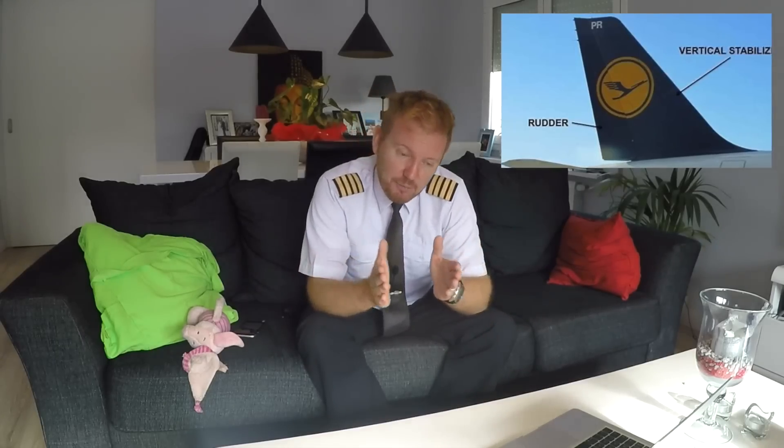The rudder is much bigger than most other control surfaces because it has to control the aircraft at very low airspeed — when there's very little airflow over the fin — in the case of an engine failure. The engines out on the wings produce a lot of forward thrust. If during a takeoff run one engine fails, the other engine is still producing thrust, creating a momentum towards the center of the aircraft. Without rudder input, the aircraft would just yaw off the runway. Since we have the rudder, we can apply opposite rudder to counteract that momentum and control the aircraft either until we've rejected the takeoff and stopped, or until we've taken off.